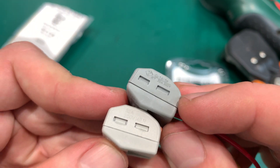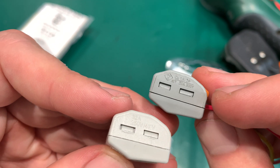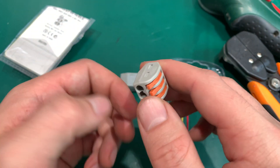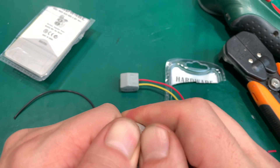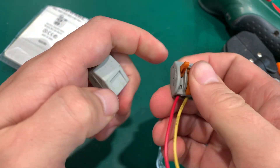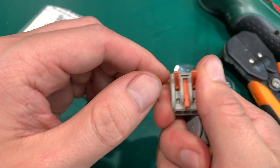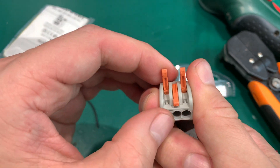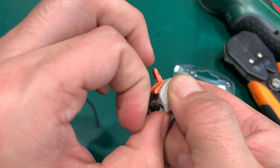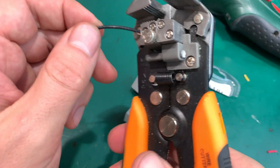Here we've got some insulation markings: 4KV, 32A, 250V nominal. And the first test is what kind of retention do we get? Because that's the most critical part. The retention is lower — there is not that amount of force, and that will directly correspond to how strongly it holds a wire.